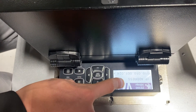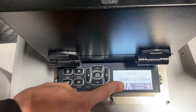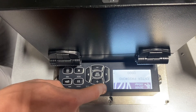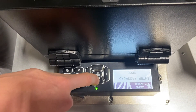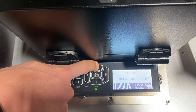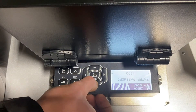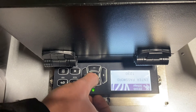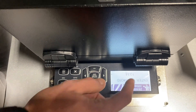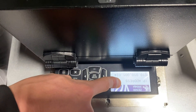If I want to change the IP address, I can hit the plus button — it'll ask me for a password. Zebra's default password is 1234. To enter the password, you would hit the plus sign once and you see that my first character changed to one. I would then hit the minus to get to the next character and hit the plus button twice, minus again, three times, minus again, plus button four times. Once I see 1234, I hit the right arrow and now it'll allow me to change the IP address.